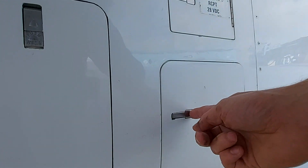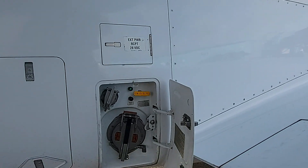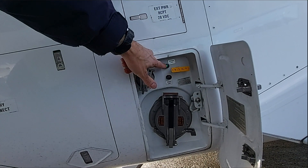This is the toilet servicing panel. Once you open this panel it starts a timer of 15 minutes and you are able to empty and refill the toilet. After those 15 minutes you cannot empty the toilet anymore as the inner bung valve remains shut. You can also notice this by looking at the green LED light. Green LED means 5-6 liters are in there, and when the green light turns off that means the 15 minutes are up, so you cannot refill or do anything with the toilet servicing anymore.